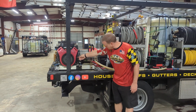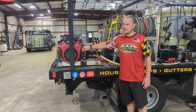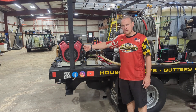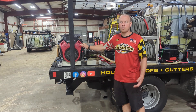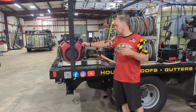When you get in here, you're going to start to turn that on. You just pull your choke — if it's cold; if it's hot, you're going to pretty much just turn it. You're not really going to mess with this throttle — that gets RPMs up and down. Once it's running, we could go down low if we wanted to reduce water pressure, but in general we do that with tips.